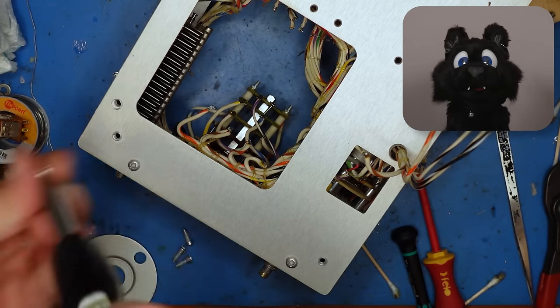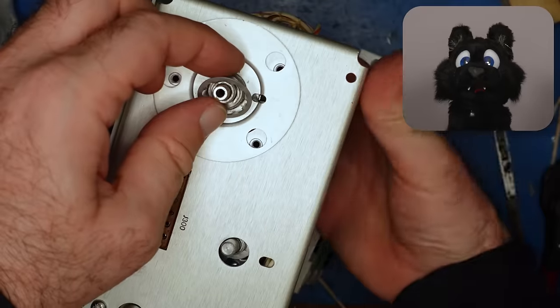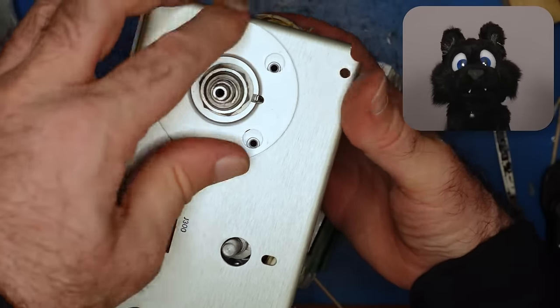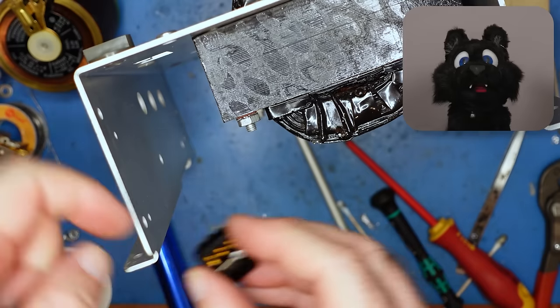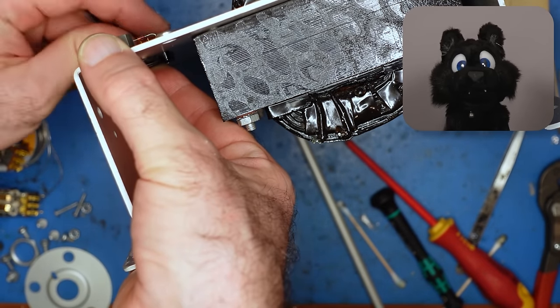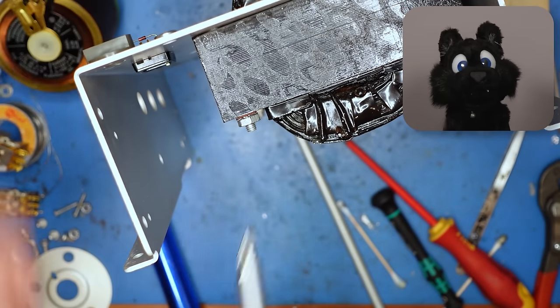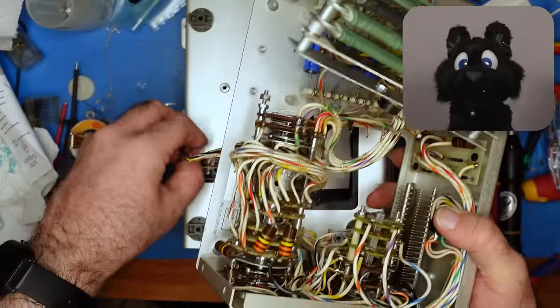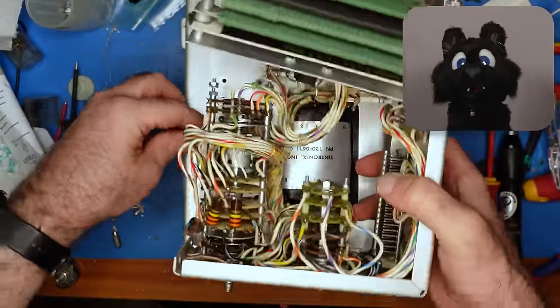I kept wondering why the supply was so weirdly tucked into that enclosure. The answer is that the collector emitter voltage is not grounded. The collector supply has a different circuit ground than the rest of the instrument. A floating supply, as it's called. I thought the insulation was for high voltage protection, but the floating aspect makes it doubly important.